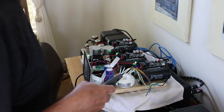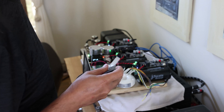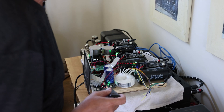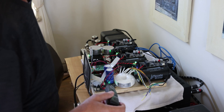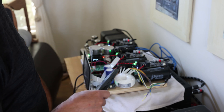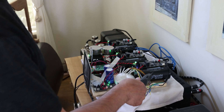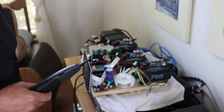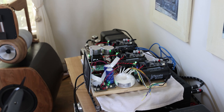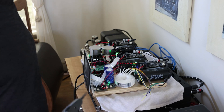The Raspberry Pi, because it consumes a lot of power, cannot run from ultra capacitors. So it actually has its own power supply — Ian makes these beautiful linear supplies, you can get a link below — and it also goes to another, smaller ultra capacitor bank and then goes into the Raspberry Pi. That one has its own supply which keeps running continuously. It's not ultra pure like these, but because it's running for the Raspberry Pi which is already the dirty side anyway, it's not as critical. It's always about getting the best power when the sound passes to the next stage. But nevertheless, this is still a very low jitter, very low noise, linear power supply.